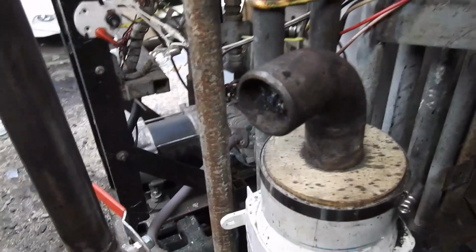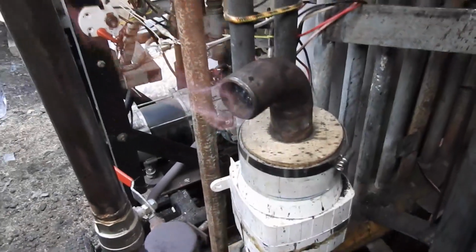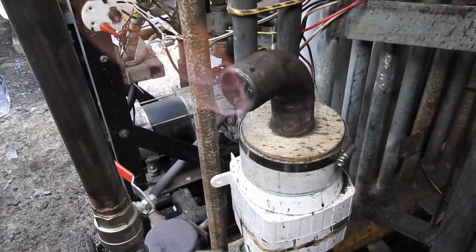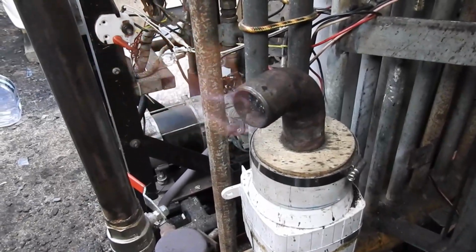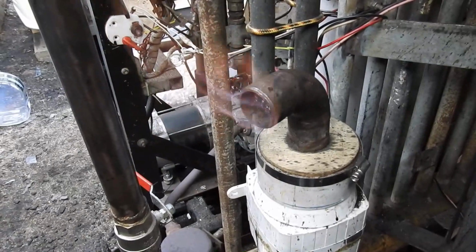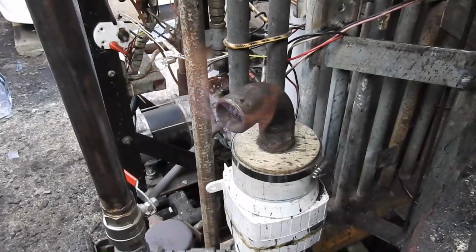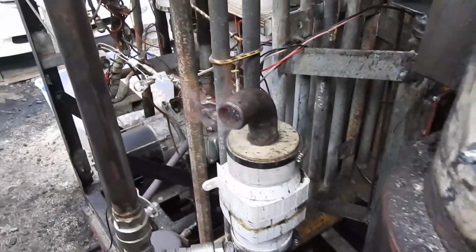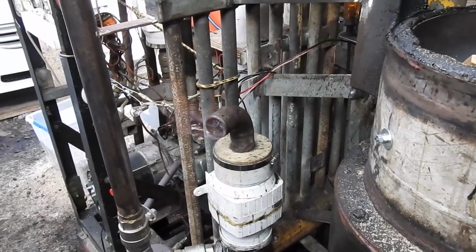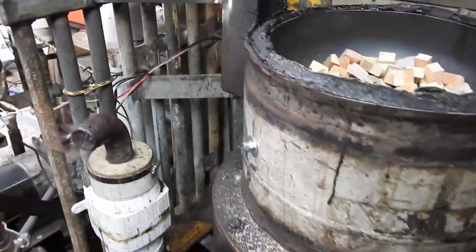Right, as you can see, thick, choking, tar-laden smoke. That's still cold. I lit the gasifier maybe 5 minutes ago and it started out like that. Normally I'd expect maybe some yellow and other dirt in the cold outflow from the gasifier, but no, it's actually very friendly coloration there. I have noticed that the gasifier is running cleaner than it was before, and the filter lasts much longer between cleanouts. So at the moment it would appear that the effort I put into this is paying off.